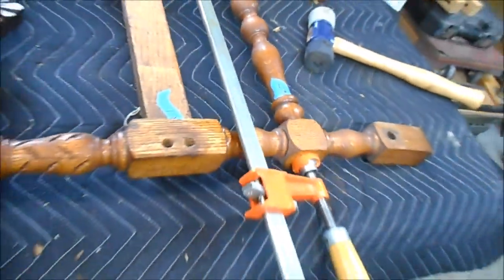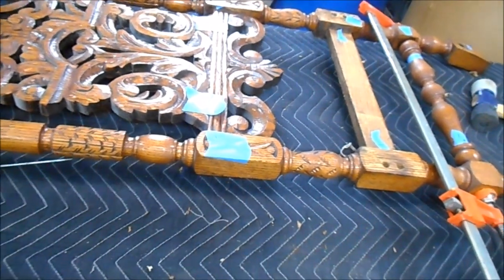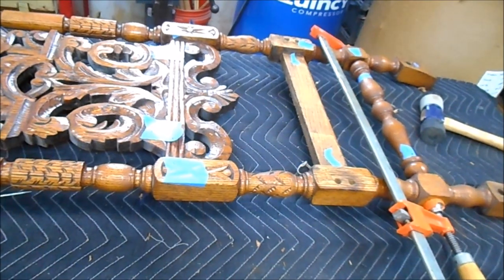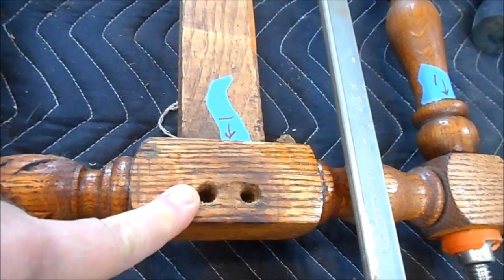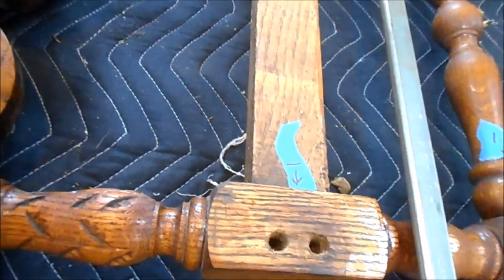And then down here, we're clamped up across that bottom stretcher that we glued. So we'll leave this set for a while, and then I'm going to get to work cleaning the joints, the dowels, and the holes in the rest of the chair, clean up all the old glue squeezes and messes, and we'll be ready to put this back together once all the repairs set up.